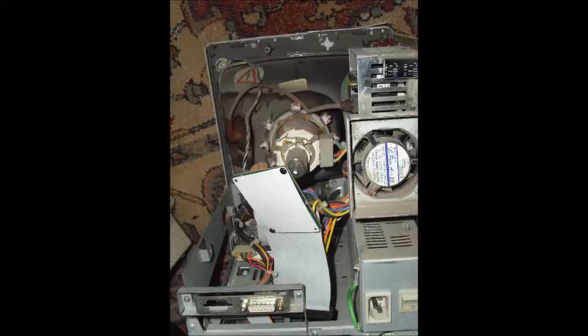Upon opening the unit — which I recommend doing before you try turning it on — I can see right off the bat that the portion that connects to the back of the CRT display is disconnected. That won't hurt anything turning it on that way, but you obviously would not get any video. Fortunately, the stem is not snapped off — that is one of the delicate pieces of the back of the CRT, a tiny glass stem that in some cases snaps off inside of that board. The CRT is intact, but upon opening, that board was not connected.